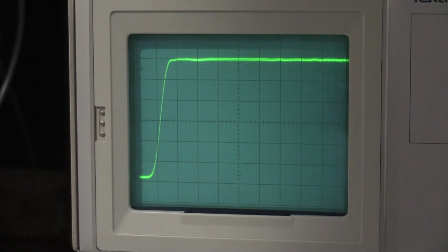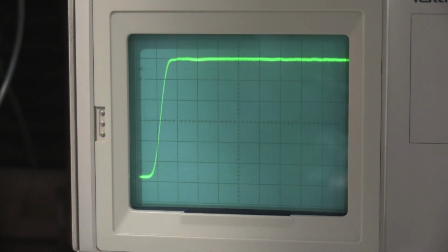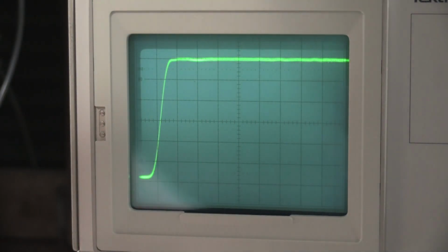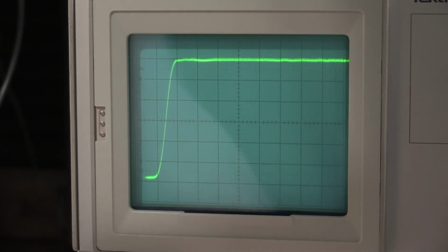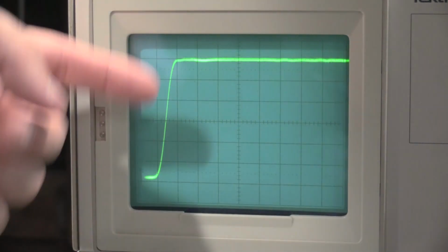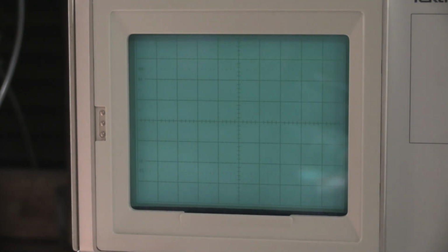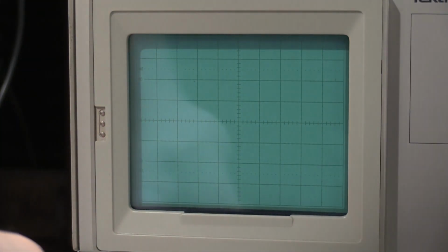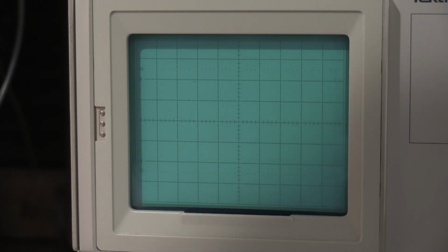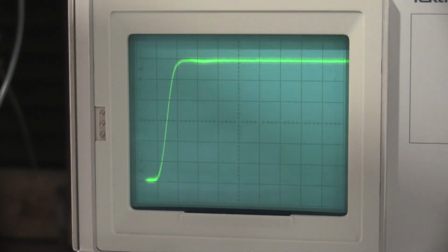Okay, terminating the function generator in pulse mode and setting it to a 5 nanosecond pulse, as fast as it will go, I have done the high frequency compensation. This is the step response I got out of channel 2, which is really good actually. Let's see, step response out of channel 1. Which is also pretty good. So I'm happy with both of those.